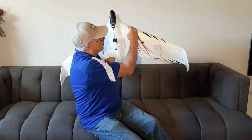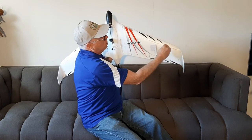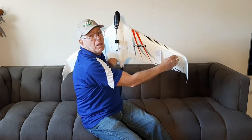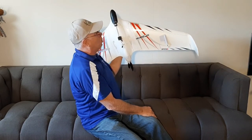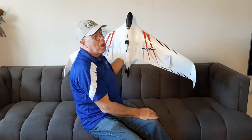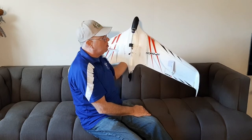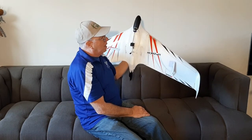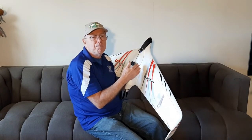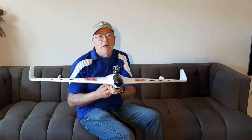You do see some on the more generously swept flying wings where guys have removed the upward vertical tail, carved the wing to a curvature, and left the leading edge blunt. What happens is that as the wing starts to yaw, that blunt edge on the wingtip drags the wing back, so they can get away with no vertical tails or very small ones — and then you don't get that yaw waggle in gusty conditions. It's very disconcerting when flying FPV that the airplane is yawing and pitching on gusty days; it's actually nauseating to fly a flying wing that isn't well damped in both pitch and yaw.